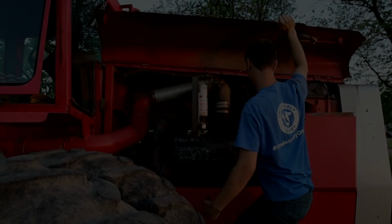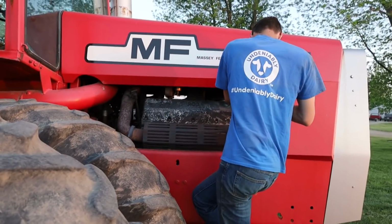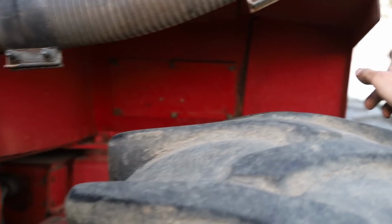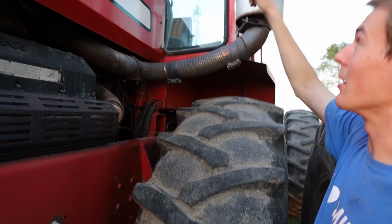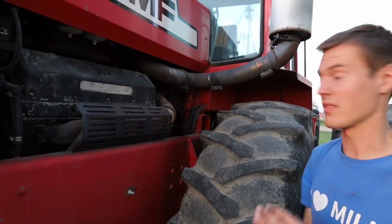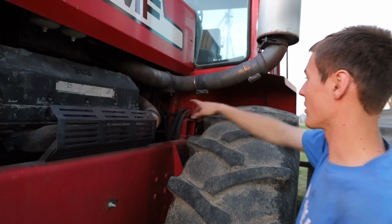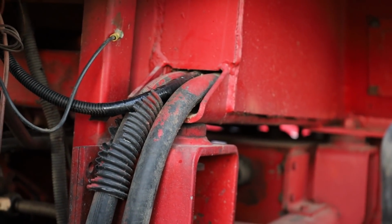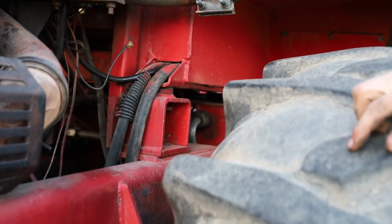I don't know. Didn't do anything on this side. Last time we had 2 or 3 wires running back to this access panel, which had a relay in it. The key sends power down and turns that relay on, which turns everything on up top: blower, radio, AC, etc. That wire shorted out and they didn't have a fuse on it. When it shorted out right here on this pinch point, it melted everything back, as well as all of the harnesses it ran in and the nearby harnesses. So we had like 3 melted harnesses and probably 10 different wires melted through.